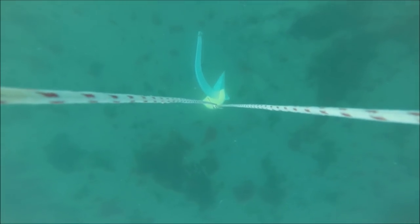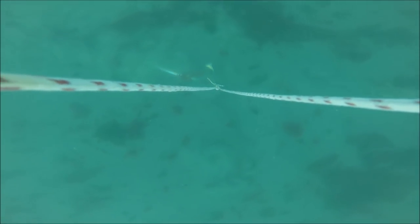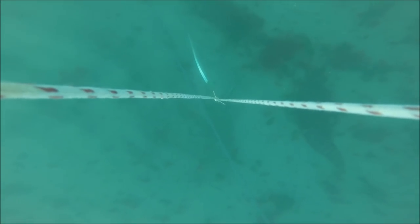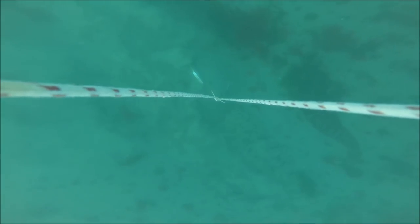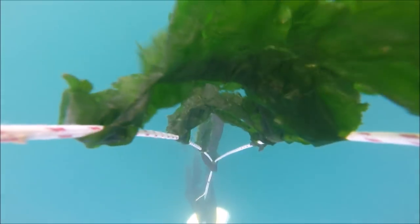Here is the Spade anchor — it sets initially very hard. There's a crab running off to the right, and a chain whizzing by; I just about nailed the reverse. It came right up over the anchor, showing a real good full 180-degree swing. The anchor sets quickly and stops the boat. These are all at 3.5 to 1 scope. On retrieval, there's nothing on the anchor other than a piece of seaweed on the shank — it came up real clean.